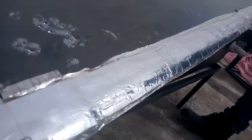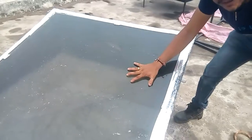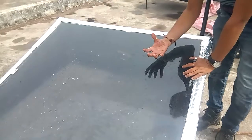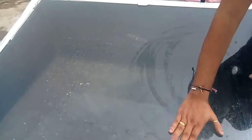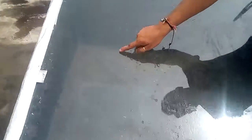The working principle is: sunlight traps inside this container, and the temperature of the water inside will rise up to its boiling zone or evaporation zone. The vapor will start moving upwards, settling on this glass and condensing. You can see the water vapor droplets here.